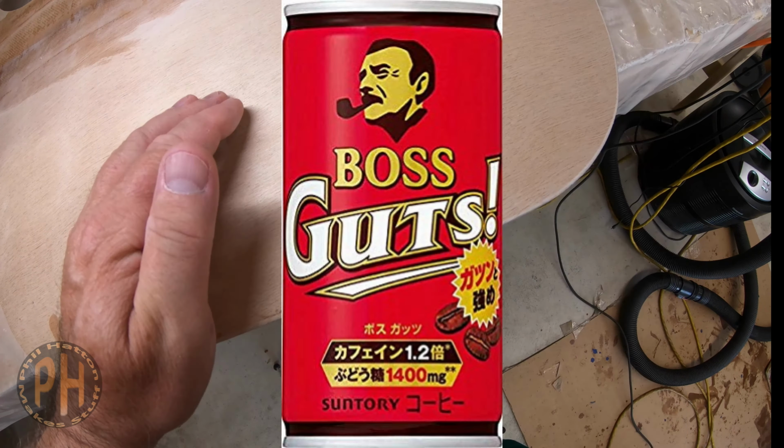The door stiffener stiffens the door, but first you need to do a little fitting. I'm pretty sure everyone's camper comes out a little different, and depending on things like humidity, temperature, altitude, the phases of the moon, and other mysterious factors, my doors wouldn't quite fit your camper and vice versa. So I marked the doors and the stiffeners with a pencil to keep the alignment and mark where I wanted to sand. I sanded a little bit, checked the fit, sanded a little more until I crept up on what I felt was a good fit.